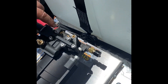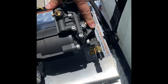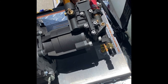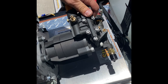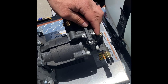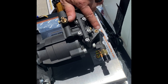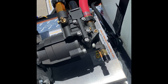On the manifold of the pump, this one has two different fittings. A lot of high-end pumps will have a 17-millimeter fitting on the side of the brass or nickel manifold that you can bleed off of. The main thing is being careful not to tighten or loosen these while the machine is running, because you can strip them out — and once you strip them, the pump is done. There are two here; I'm going to release the top one first.